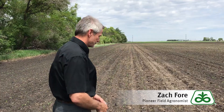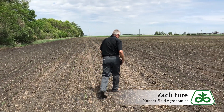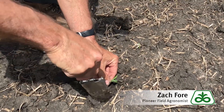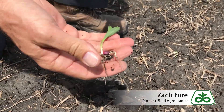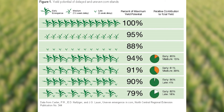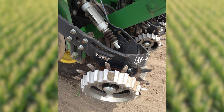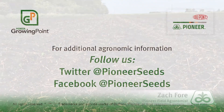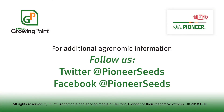That's really what we want to identify as we're doing this field evaluation — how successful were we, what worked well, what didn't work well, and what can we do to improve for the future. A lot of times when you find a plant that didn't germinate and emerge uniformly and you dig it up, you'll find that the planting depth was different — shallower or deeper. Those are the kinds of things we want to observe and then ask: was our planter set right, do we have the right equipment, are our openers worn, do we have enough depth control? And another really important thing is residue managers — are they working properly, are they kicking residue out of the furrow? Sometimes when they're trenching, soil can wash back in and seeds end up too deep. That's another important thing to evaluate.